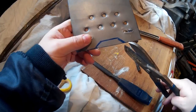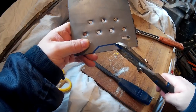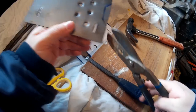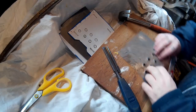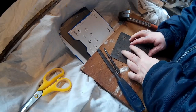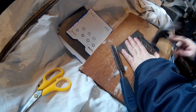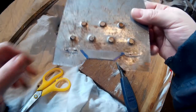Now we're just going to cut out the little bit at the bottom. Do it on the outer side of the line — just do the two short cuts and then fold it over. That creates a stiffer part. You could fold it over by hand to get a neater edge, then flatten it down with a hammer. That just makes that little bit a bit stiffer — you could just cut it off, but folding adds a little bit of stiffness.